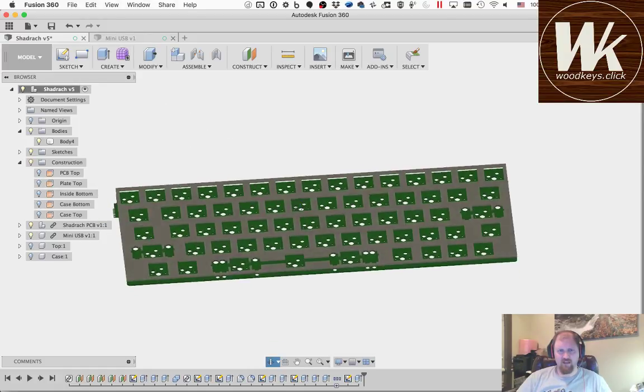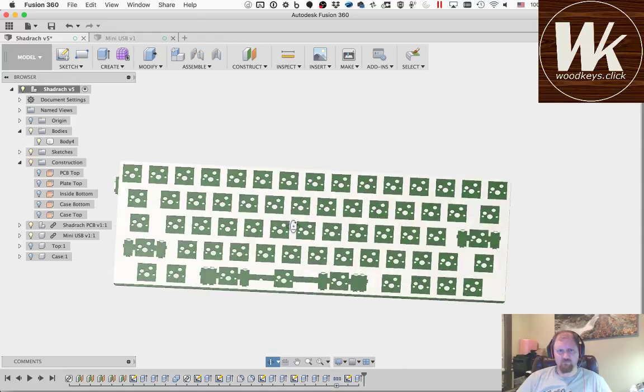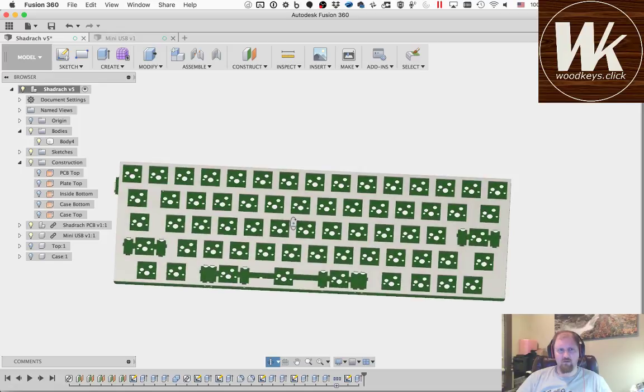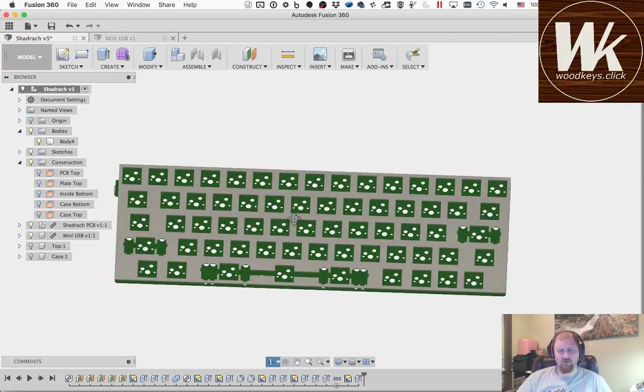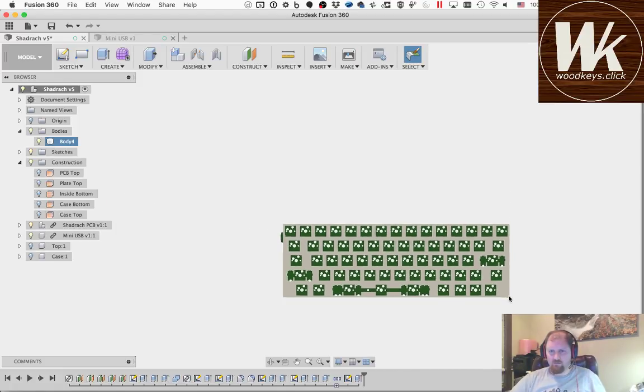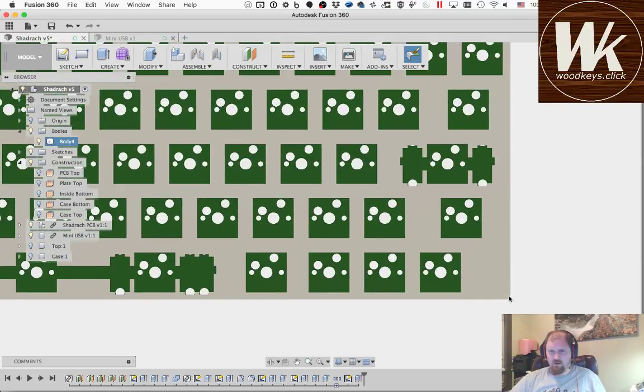That plate needs to have holes in it, and those holes need to line up with. We need to move this over, didn't we? So we need to shift it over just a hair, and now's the time to do that. And we need to add some nice rounded corners to it because I don't like plates with pointed corners because they can catch you and among other really obnoxious things. So I wanted to shift this over.